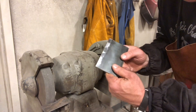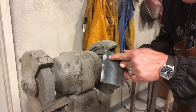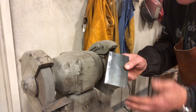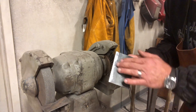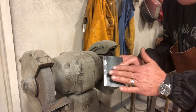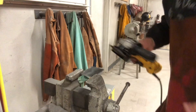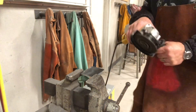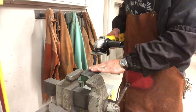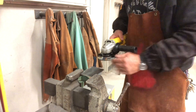You can see how that wire wheel took the rust off, but we still have some stuff here. You can weld right over top of that for our welds — it's not that big a deal — but if this was a structural weld, you'd want to get rid of that. So we can take it to a grinder or an angle grinder to get that even better. Here we have an angle grinder. You can use it to get rid of the mill scale and any other rust so you can have bare steel to weld on.